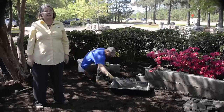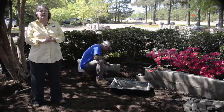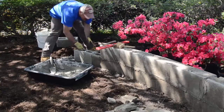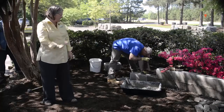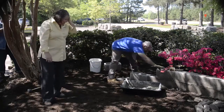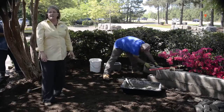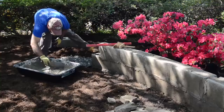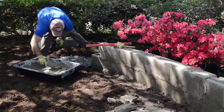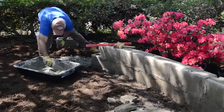We're going to move to our last segment — a stone veneer wall. Stone veneer has become really popular, and there is stone that is cut to make a stone veneer wall look like a dry stack wall. We're going to do an applied face to this one with natural stone and as little cutting as possible. Daniel has excavated below the wall, put a base of gravel beneath it for support, and is using simple concrete blocks. You can get a curve with a straight concrete block beautifully as long as you're doing a very gentle curve.